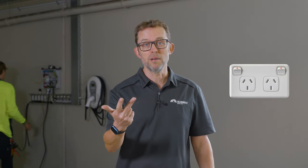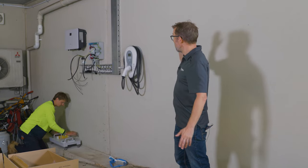This unit is on a single phase supply, so backup is fairly straightforward. If I had three phase, one of the great things about Sungrow is they're one of the few hybrid inverters that can do proper three-phase backup. I'm not going for whole-house backup because this Sungrow unit is limited to 25 amps. For example, the EV charger would pull 32 amps immediately and pop the breaker. So we just back up essential circuits — if the grid goes out, you'll still have lights, the fridge, and a few GPOs for the TV or charging phones.